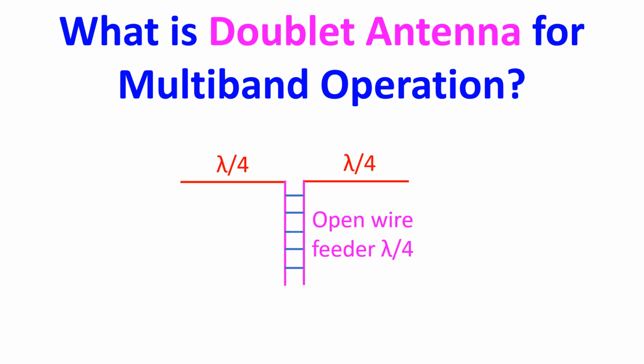Basic principle is that each half of the top and each wire in the balanced feed line must be of equal length. Antenna top is cut to resonate at any particular frequency to suit the location. Typical length of one section of the top section is quarter wavelength of the lowest frequency one is planning to operate on. Hence, it will be 20 meters each if you are planning to operate from 80 meters upwards.